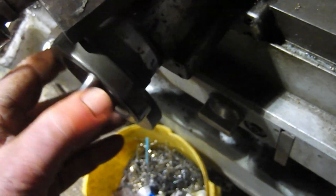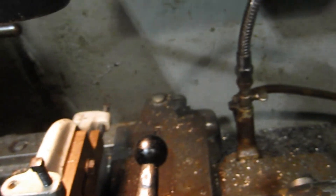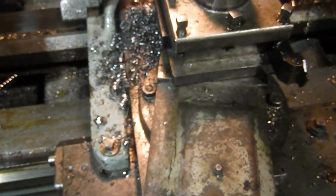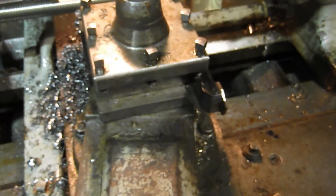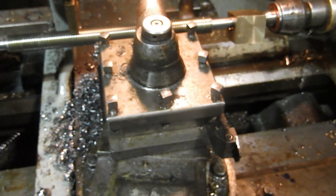Let's back it out. I've used a blue mark because obviously I can't see the zero — I have to make a new zero point because I can't see where the zero is, as I've got the cross slide angled across at 14 and a half degrees to give me the infeed for the tool at the correct angle for cutting the thread.